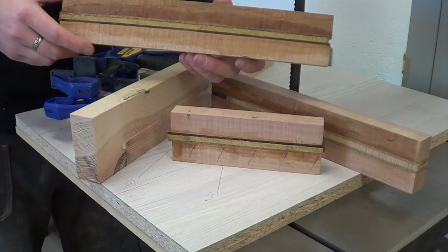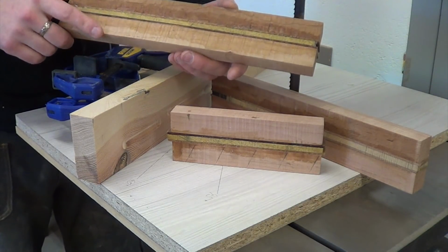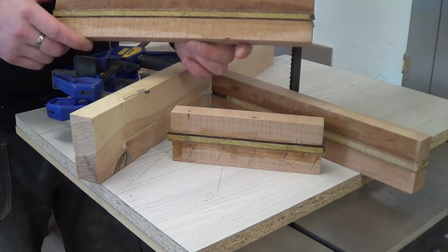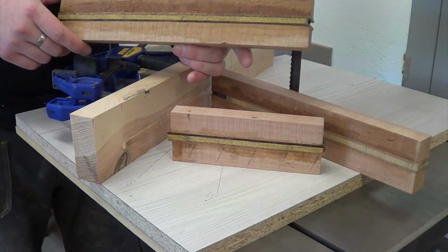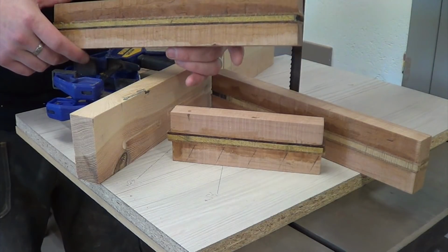All the strips I need laminated together that will make up the feature ring. This should be enough to allow me to cut 20 strips at a 25-degree angle that, when flipped around, will make 10 segments of the chevron pattern that I can cut angles on to make up the feature ring.